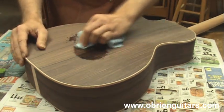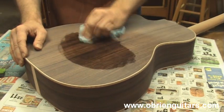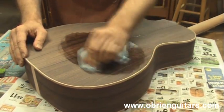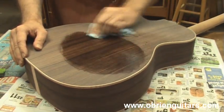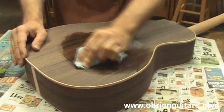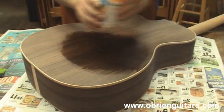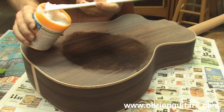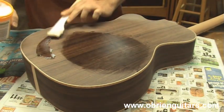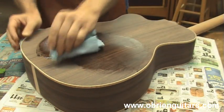Just come in and work it into the grain. One of the cool things about the product is that it applies very easily. Just wipe it in there and you can keep it really clean, so there's very little sanding required with this product. Now it is water-based, so it's going to dry very quickly — work in small areas. A little bit goes a long way.